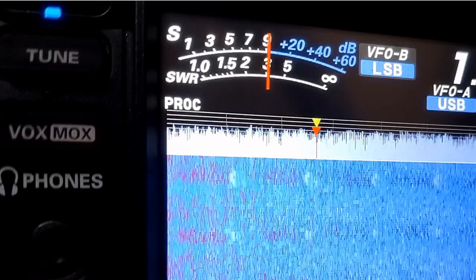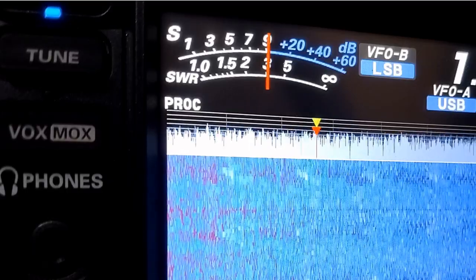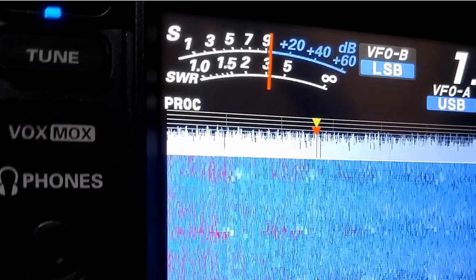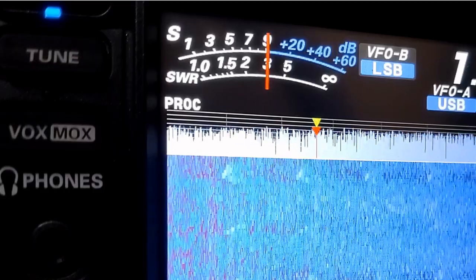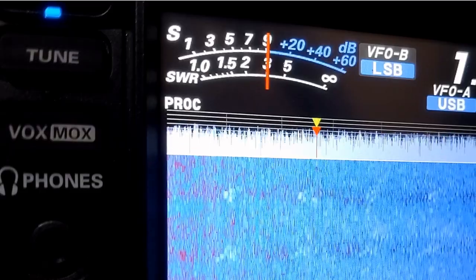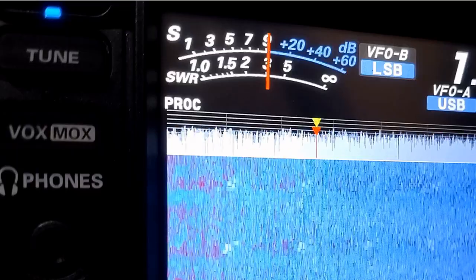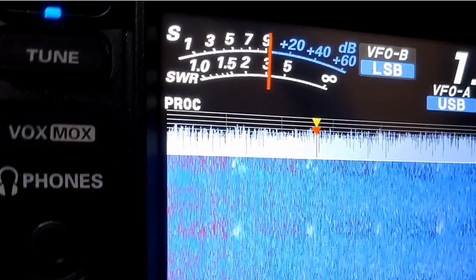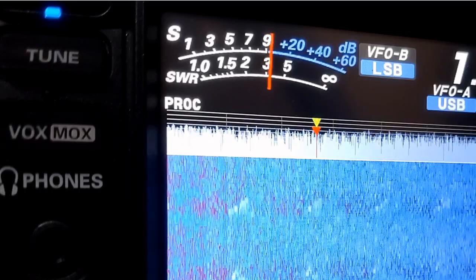This is a feature of most modern SDRs. It will cut down the output when you try to use a band in which SWR is high. The same thing happens if your antenna is disconnected — if you try to start transmitting without the antenna connected, the same thing happens. That is an important protective mechanism in modern software defined radios to prevent damage to the final RF stages.